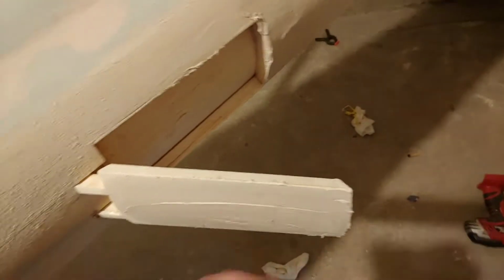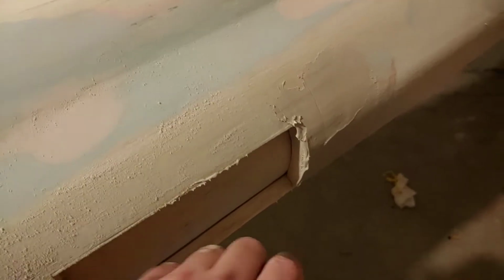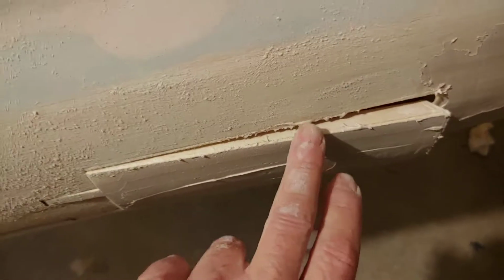And I did some repairs. I also corrected the size of the air brakes. And this one had a ding in it, so I overfilled it and I will sand it off. And then I will glass these as I would anything else, and that's going to make it a whole lot easier when I make the channels for the 50 millimeter linear actuators that go in there. And again, that is something that will go from this area to this area, and then they will open and close.